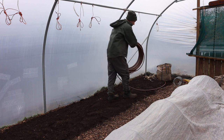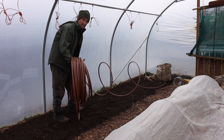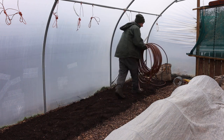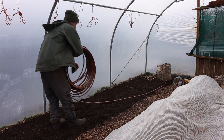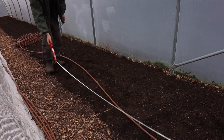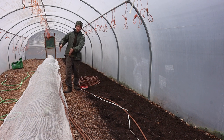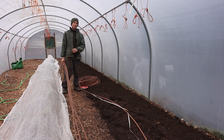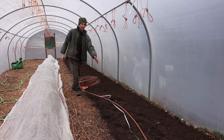Really crucially, don't pull the pipe out like this — you can see all those kinks where it's conformed to that shape, like a spring. If you face it the way the pipe's coming off and then walk back slowly letting it out, the pipe comes out much straighter and flatter. Prior to filming, I'd already worked out I needed two 25-metre lengths and a 20-metre length for the middle, and I pre-cut those with a little leeway added, a few metres, to account for measuring inaccuracies.